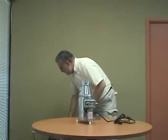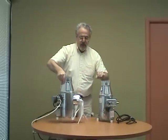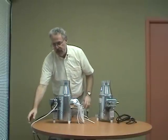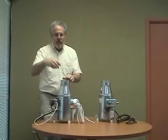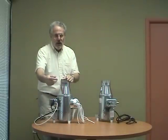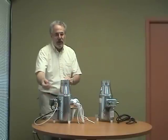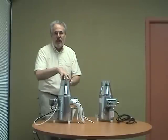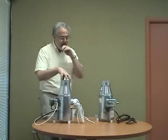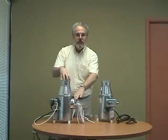To show you how it works, this unit is set up with some stringers so you can see the airflow. The dryer is say over here and you run dryer pipe — 4 inch pipe — from the dryer to the inlet on top of the fan. Use either hard smooth pipe or hard flexible pipe, both of which Marcon sells and both of which are easily available. Another piece of the same stuff from the discharge arm on the side to the line.